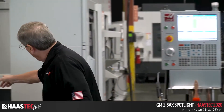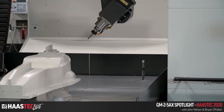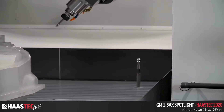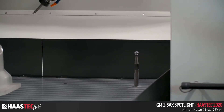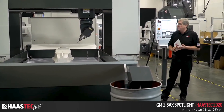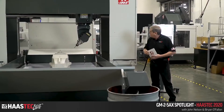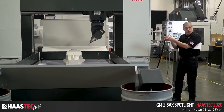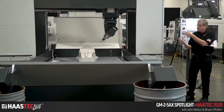There's a tooling ball mounted to the table. We probe that tooling ball in a couple of different positions and store the values in settings. This tells the machine the location of the center points of the rotary axes within the machine envelope. For a five-axis machine with a tilting head, key values are the location of the center of C-axis rotation and center of spindle rotation. These are mechanically assembled with some error, which we measure and compensate for.